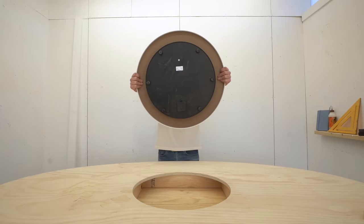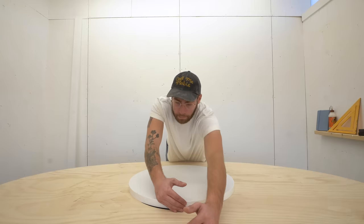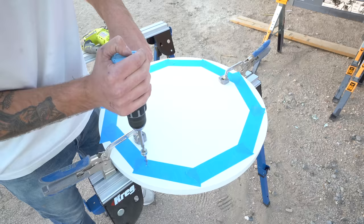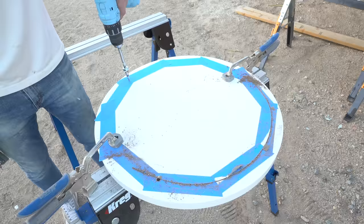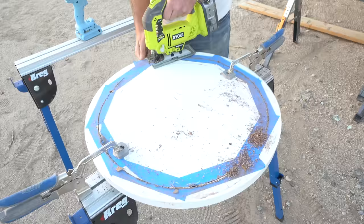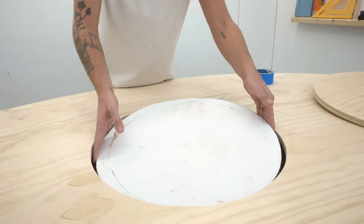This is the motorized turntable I got for the table, and unfortunately I bought the wrong size. I was originally going to do a 24-inch circle in the middle, but I didn't think that left enough room on either side for a plate. So I shrank it down to a 22-inch circle. Thankfully, this is just MDF with some kind of laminate plastic on top, so I'm going to be able to jigsaw it down. I clamped it really tight and used a laminate acrylic blade to trim about an inch and a half around each edge. I left a link below to an 18-inch turntable on Amazon that should work great — no modifications needed. And I'm happy to report the turntable still works after jigsawing the top.